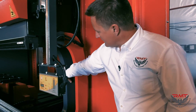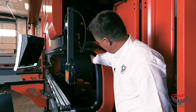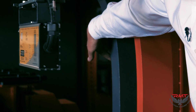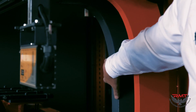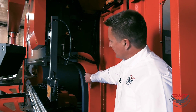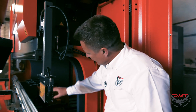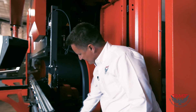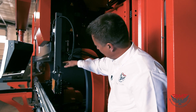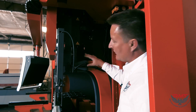This is our mainframe here — you notice it's got a deep throat on it, standard. All our machines typically have a lot deeper throats than pretty much any of our competition. Our between-frames distance is what you're really concerned with. Now, you notice here there's another C-frame. This C-frame acts like a strain gauge and automatically compensates for any yaw. Depending on tonnage, I'm going to get a little bit of yaw right here. This C-frame is never under load, and it's connected to our precision scale tucked up in here out of the way. So if we get any yaw, this is automatically going to compensate for it — it's a really simple, bulletproof system to compensate for strain or yaw.